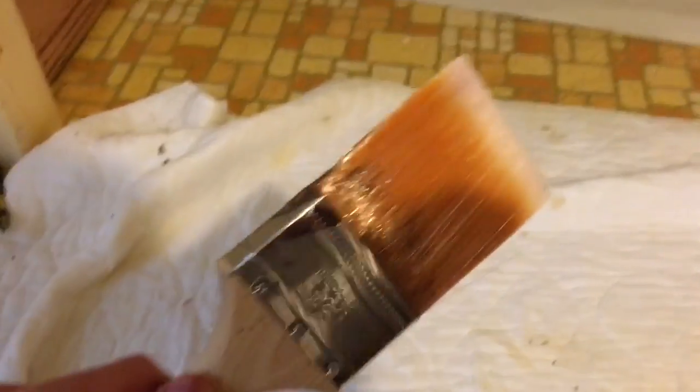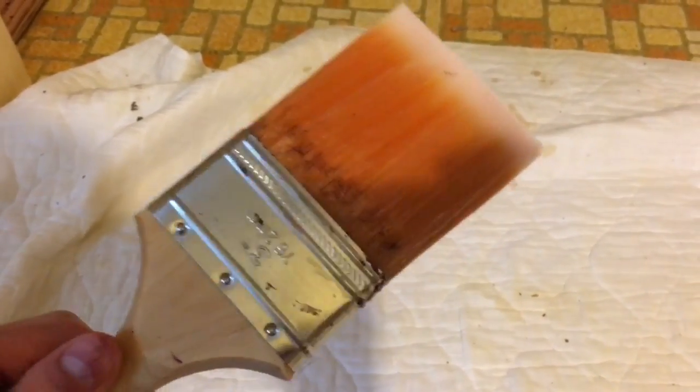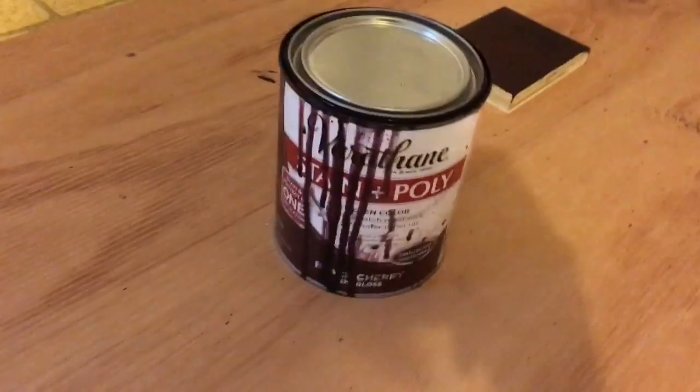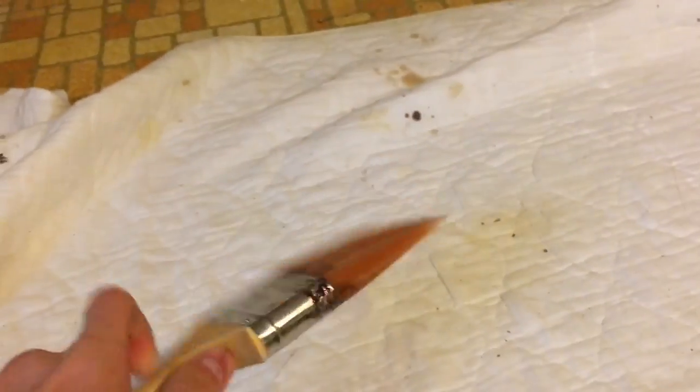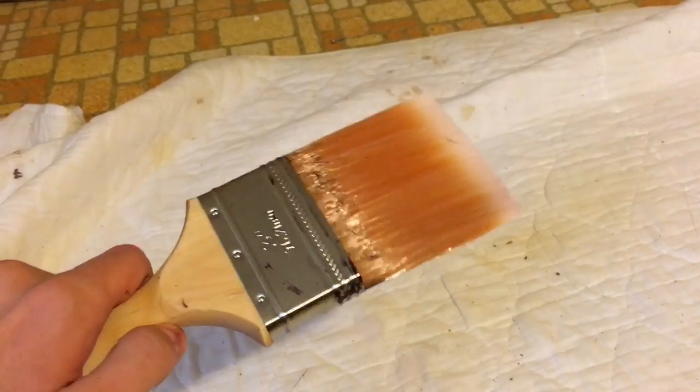But I wanted to say one thing that I discovered after completing it, because at this point I'm at either 2 coats or 3 coats depending upon how you would measure my painting style. This is the brush that I used, and while there's still a little bit of stain kind of dried onto the bottom, I thought that something that inherently was designed to stain would stain things. And I was amazed. But if you clean up immediately after you do your stain, as long as you're using, again, this particular brand, I don't know if you can read it anymore, you can save your brush and use it for future projects. These are synthetic fibers. We got synthetic fibers intentionally because we figured they would absorb less, and absorb less they did.